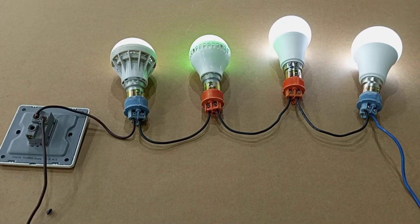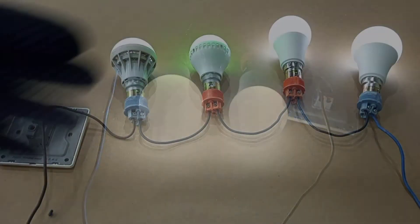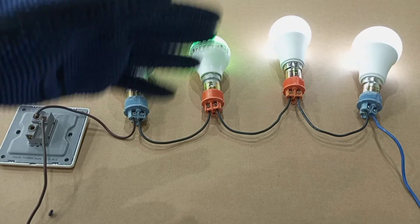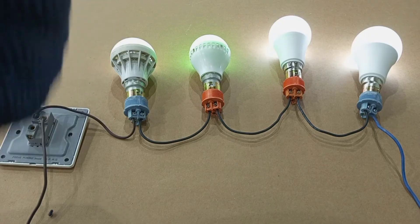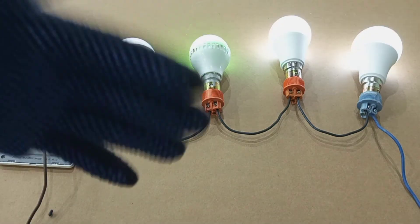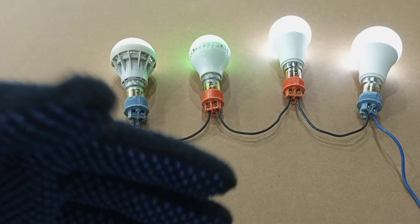So now, moving to Daniel's question: two lamps are connected in series, lamp A rated 60 watts and lamp B rated 100 watts. Which will glow brighter at 230 volts supply? I'll reduce this circuit to just two lamps to answer it. The fewer lamps you connect in a series circuit, the brighter the lamps are. The more lamps you connect, the dimmer all the lights become, because the more lamps, the lower the current that flows through the circuit — and in series, the same current flows through all.